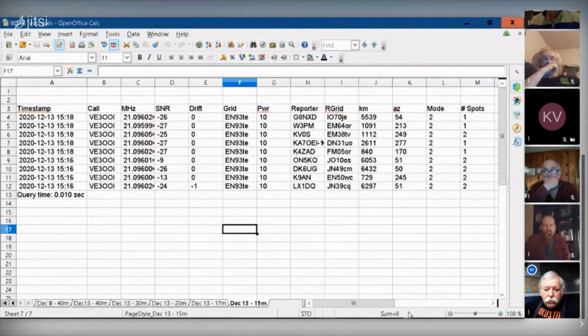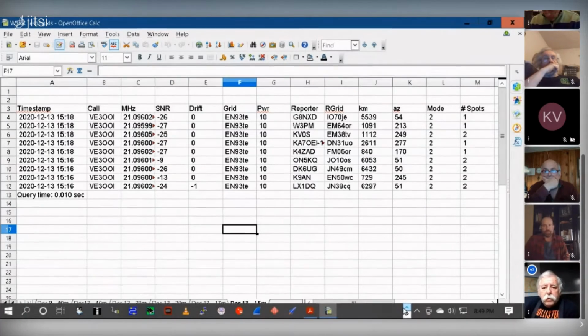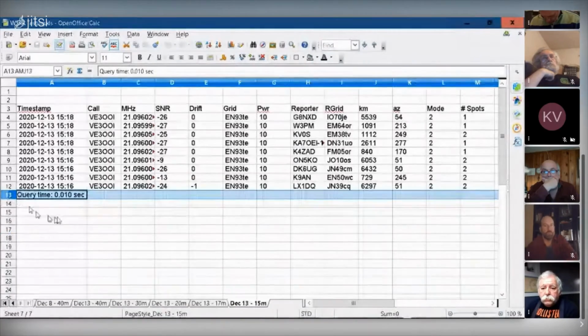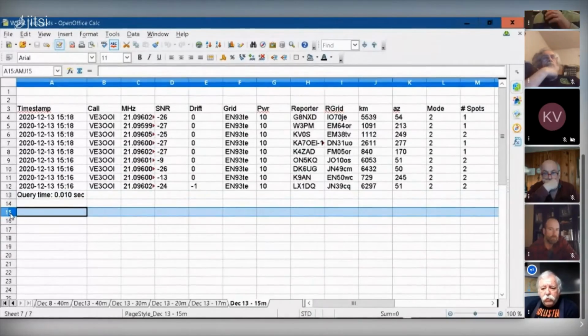Just quickly looking here, how are you grounding your station? You mean ground for the antenna ground plane? No, the station ground itself. Are you taking all of your equipment to a single point? Sure. Grounding that single point outside? Nope, it's not grounded outside. That's maybe your problem. Why would that cause noise? Because all you're doing is grounding the antenna. You should have all your equipment grounded too. That's why you have grounding screws in the back. Right. Everything is a common ground within my shack. It's connected to the household ground.